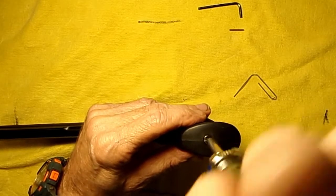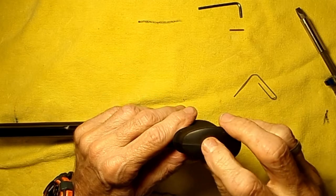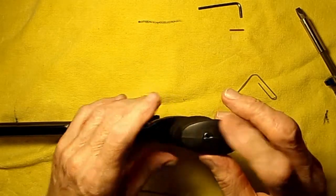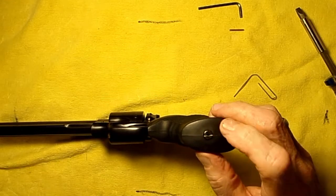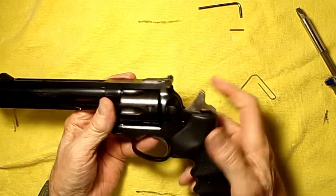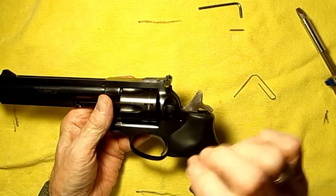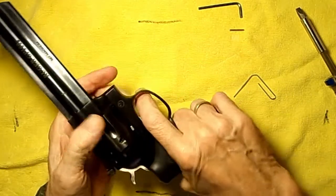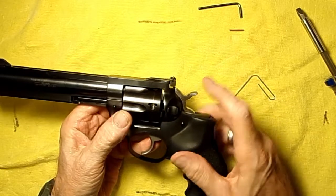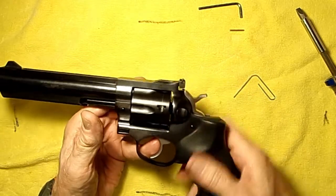And what I was going to say, Ruger is not Colt, Smith & Wesson. Like this screw here, the head of it is not the best, the cleanest. It's something that you can do yourself, which I'll show you in the next video, how to clean some of this stuff up. And I will also show you how to smooth some things out. The hammer, the strut, makes it a little easier to cock, a little easier to do the single action. You just smooth things out. It's not taking a whole bunch of metal off. It's just kind of polishing things up with 600 grit wet dry sandpaper. But that's the gist of it right there.